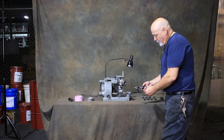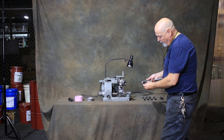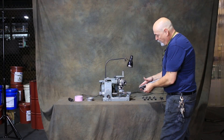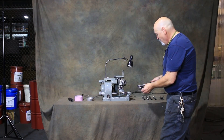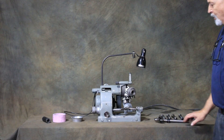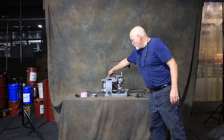And this is a nice little accessory made by Dekel. It is held by a half-inch collet, and I guess it's some kind of a fixture for sharpening drills — spiral drills. So that's an extra accessory that comes with this. That's the Dekel SO single lip tool grinder.